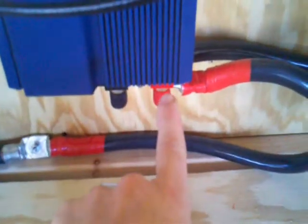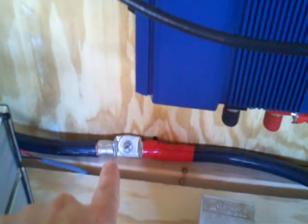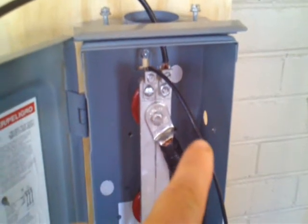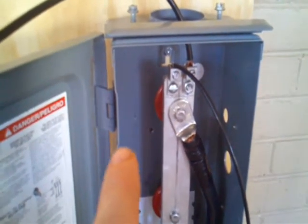For the positive off of here, I looped it around — I just extended it with another 4-aught cable. What I'll do is end up mounting a fuse right here. That was my plan there. Ran it in, connected it to the bus bar. Same thing on the negative side — out of the negative, to the inverter, through there. I'm still going to get some connectors for that. Ran it up to the bus bar. This 10-gauge wire I just have running down to a couple car batteries and a deep-cycle battery.